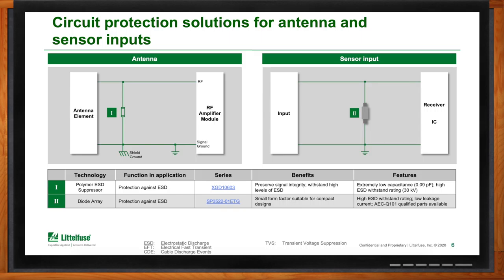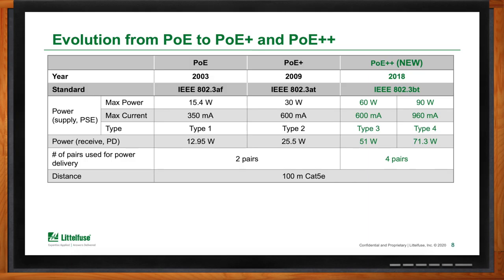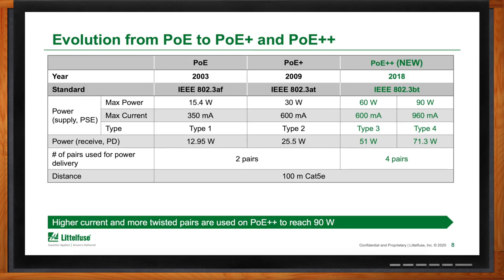One of the coolest things lately has been Power over Ethernet. Since it was created it's really continued to evolve, increasing in power with each iteration. It started as PoE, then as power increased to 30 watts it became PoE+. Now it's PoE++ at up to 90 watts. That higher power means more current and energy possible, not only to power devices but also a higher risk of fault events. This higher power is enabling more applications — such as Ethernet lighting inside an office building, providing both power and data.